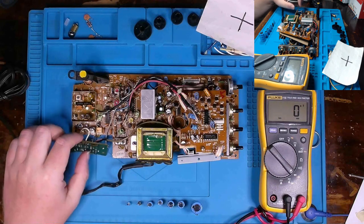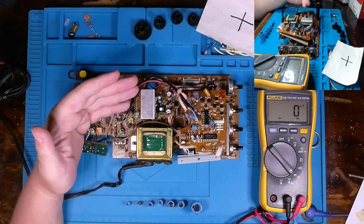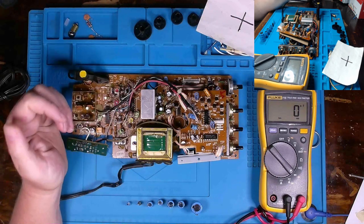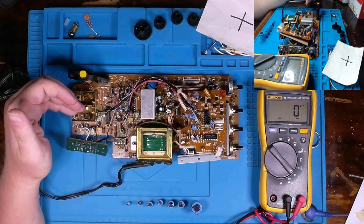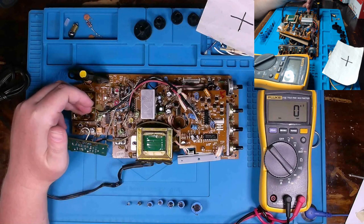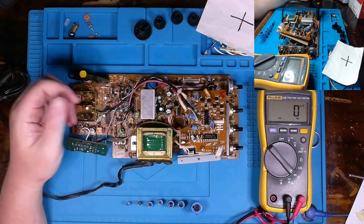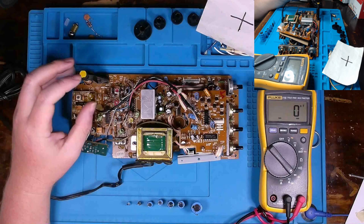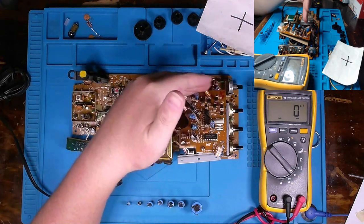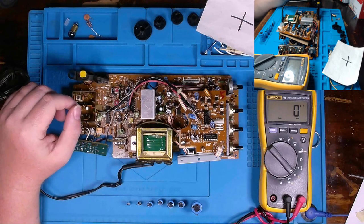If I'm in the power supply section, generally speaking, I'm looking at something within 20% of its assigned value. If I'm dealing with something that needs to be a highly accurate frequency, like an intermediate frequency, so I'm in an IF section on a radio, I'm looking for something closer to 5 or 10%, is the general rule of thumb I follow. If I'm in an audio section, 10%. There are some other things that you just develop over time.